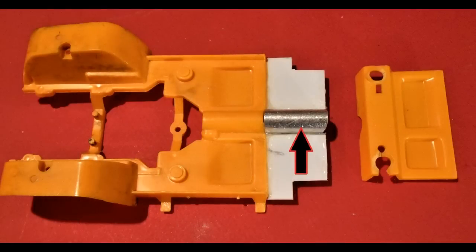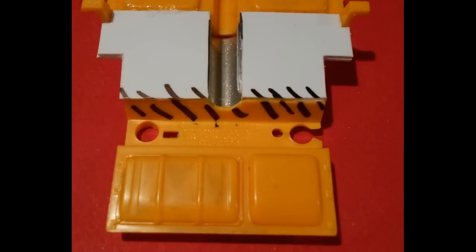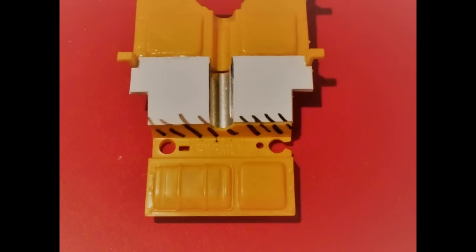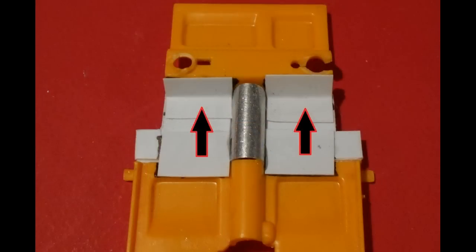With those pieces in place the chassis was starting to take shape. I grabbed the rest of the piece, which had a rise in it to the upper floor of the trunk area, and made a butt joint there with some glue. I'm going to reinforce it with some more Evergreen sheet plastic, placed into position and marked out where I'd glue the other side as well to give strength to both sides. As you can see it's coming together — most of the main pieces are in place and we just need reinforcement on the other side, the tunnel side bottom, to serve as the main strengthening pieces for the chassis reconstruction.